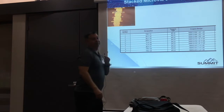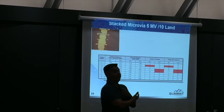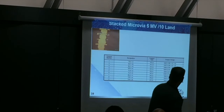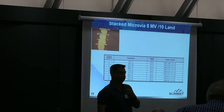These are the coupons — three serial numbers: serial number nine, ten, eleven — with six-mil microvias. Of the three serial numbers, I lost two-thirds. You really can't call it a business if you're throwing two-thirds of boards away. Especially with four lamination cycles at about 200-250 process steps. Going all that way and throwing two-thirds in the trash — they built some more, five layers, 0.5 aspect ratio, and they lost 40%. Four lamination cycles, 240 process steps, between four to six weeks of work — throwing that percentage away.